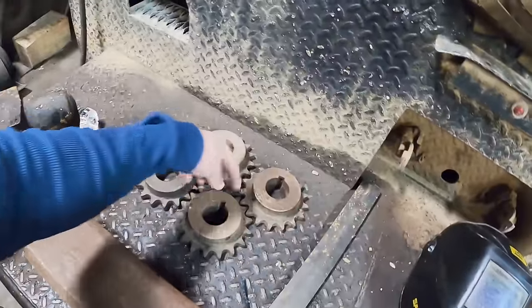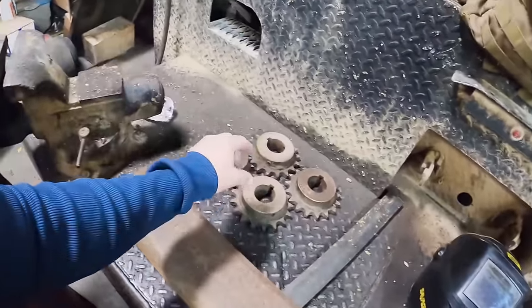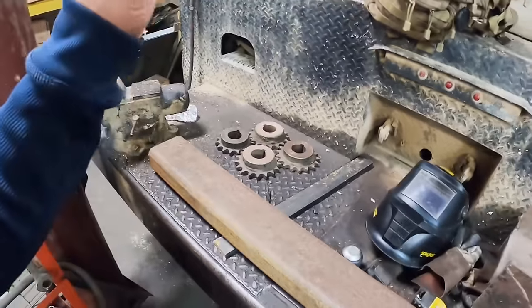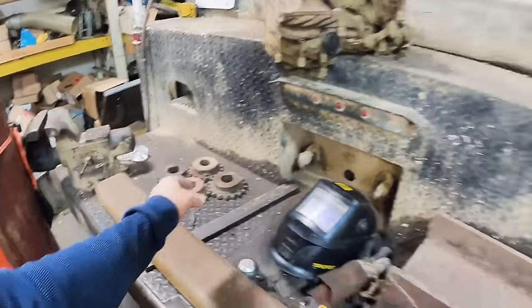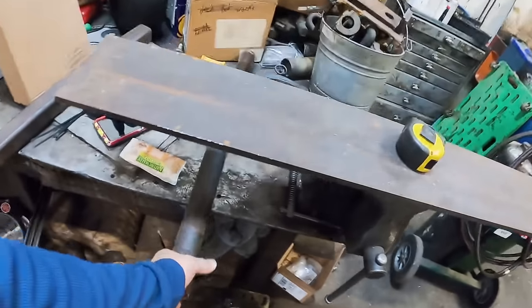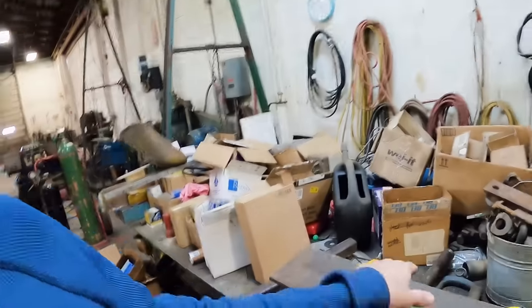And these I'm gonna use as my pin collars, they're straight bore sprockets. Anybody that's been around stuff, let me tell you, I hate straight bore sprockets, they're just good at tearing up shafts. So I found some old straight bore sprockets and there ain't no better use for them than the present. So I'm gonna use them for my collars. I found this inch and 15/16 old wallered out something or another we've taken off. Look how rotted and pitted it is. And it's even got a key cut in it. So if we get to spinning out too bad with our bucket, we got a keyway.